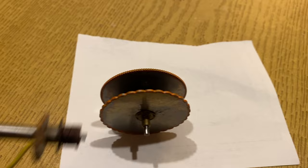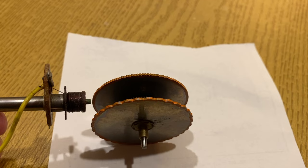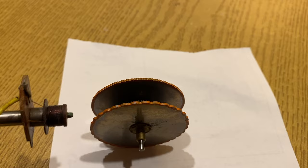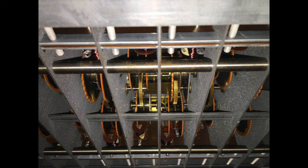Each wheel is positioned next to an electromagnet, which is held in a fixed location extremely close to the edge of a wheel. The electromagnet works the same way as an electric guitar pickup, except instead of facing a guitar string which vibrates, the teeth of the wheel rotating past the tip of the electromagnet cause a tiny current to occur in the coil of wire. For the large scalloped wheel, this produces a low note at the same rotational speed as a high note would be produced by the wheel with very tiny teeth.